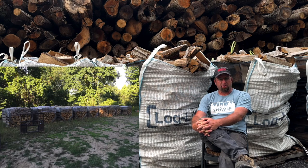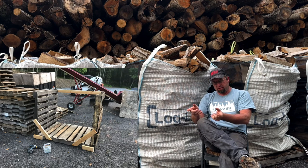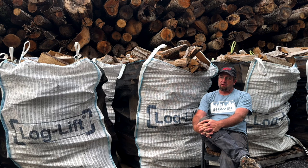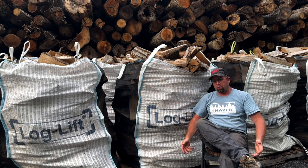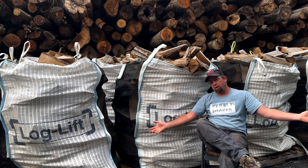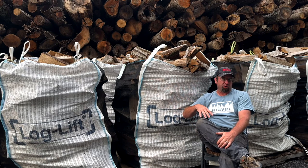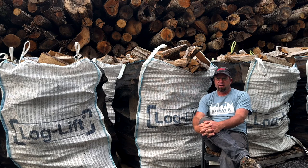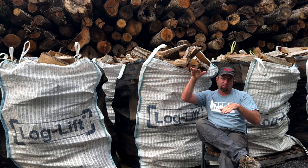We figured out a way to build racks using one 2x4x10, two little 45-degree gussets on the bottom, and a big horizontal brace across the back. That worked for a while, but after one year they'd freeze to the ground — put the forks in and rip right through the pallet, spilling firewood everywhere. After two years the nails and screws would wiggle and they'd fall apart going from the woodlot down to the house.